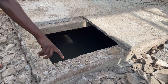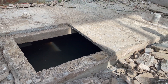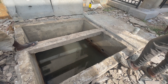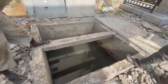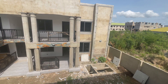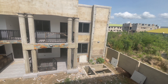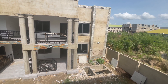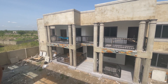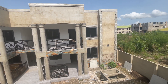It was done at the minimum with just some chipping and fiber in it, but the filtration chambers and bedding materials were not done well — it was just left in it. So it was full of a lot of water because they dug it all the way to meet the water table, which means that the area is mostly water. The key part for this situation is to make sure that you raise the inside bed, knowing that the inner pipes coming in are very good.